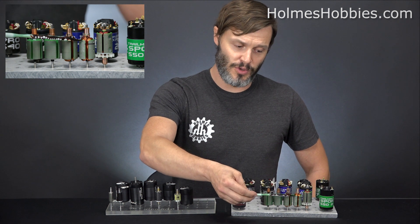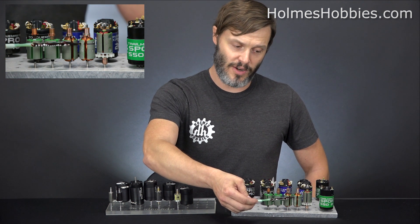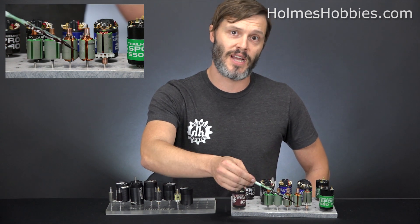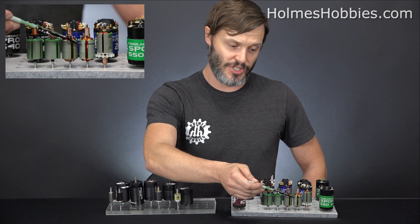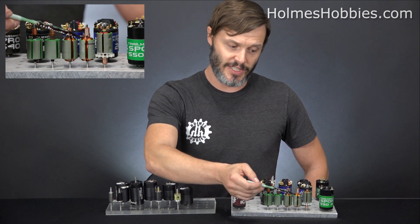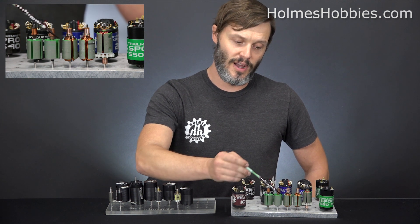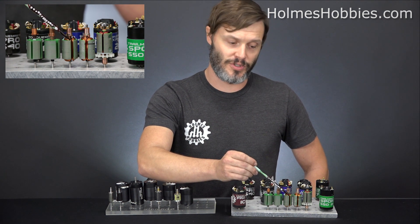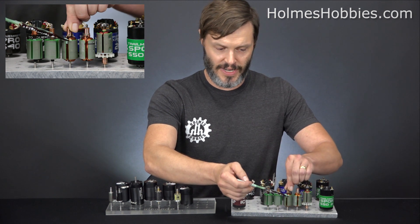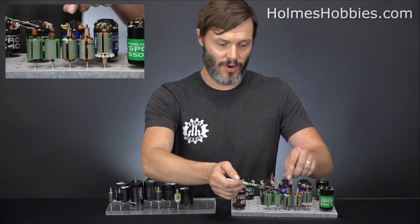If we go up to the expert line of motors — higher quality — they have thinner laminations and use M19 silicon steel, which is a better electrical steel. They also typically have a higher bonding temperature and better balancing. When we step up to the pro style motors, we have concentrically wound coils in a nice pattern, fitting a lot more copper in there, which gives you better performance, more torque, and more power.